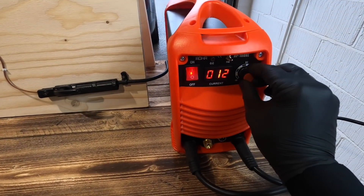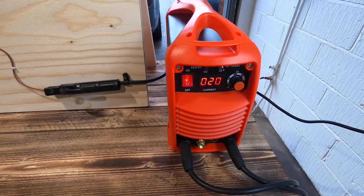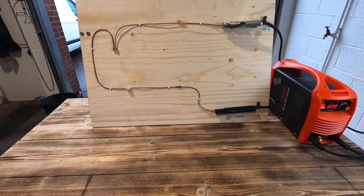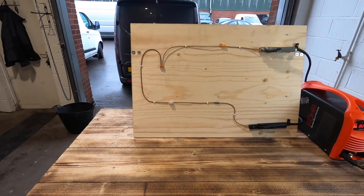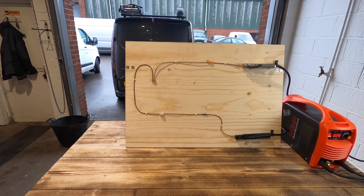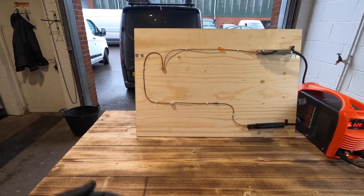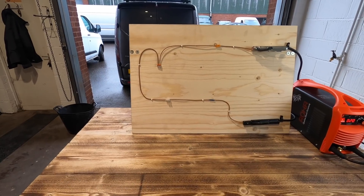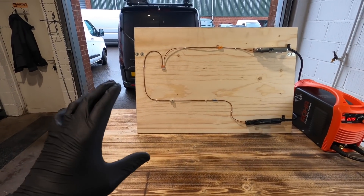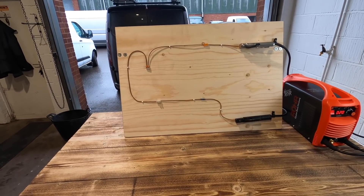Okay, so I'm going to whack this up now to 20 amps. That's on 20 now. So realistically, for the rating that it's meant to be at, the Wago and the crimp are at their max, what they're rated to. I know it's going to last a lot longer — I've seen John Ward's video and was thoroughly impressed with all the products — but to see it in person and to test it like this with a thermal imaging camera should give you guys a little bit more data.